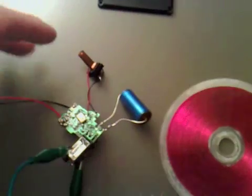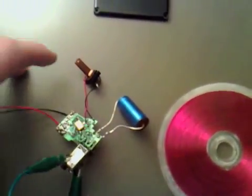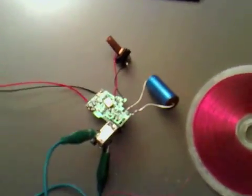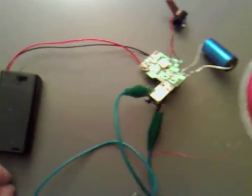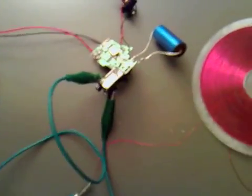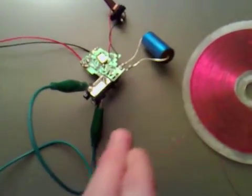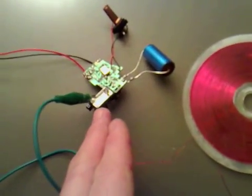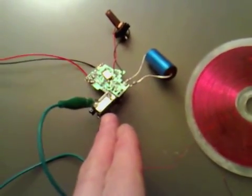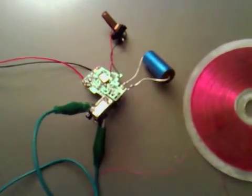The switch I'm using at the moment is two halves of a relay. I'm using it so I can get a spark gap going between it. I've hooked it up to a 3 volt supply, or about 2.5 volts, and instead of taking the leads off the capacitor I've taken it off the xenon bit of the flash, because it's got a high voltage — I think it comes out at about 600 volts.